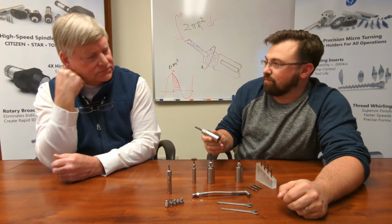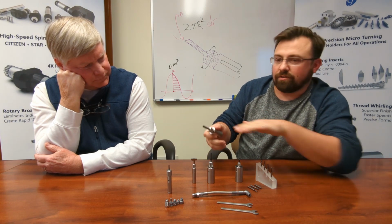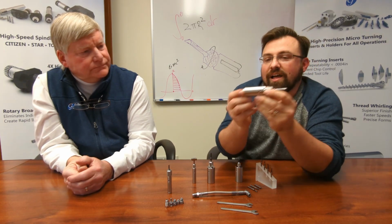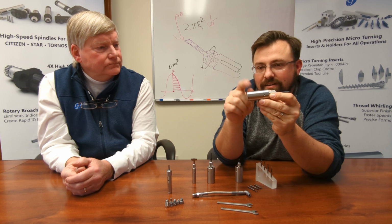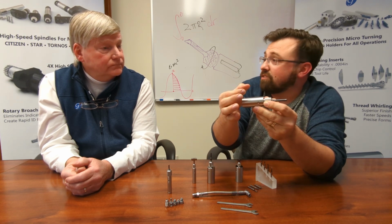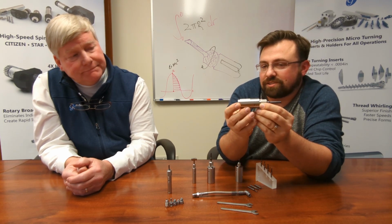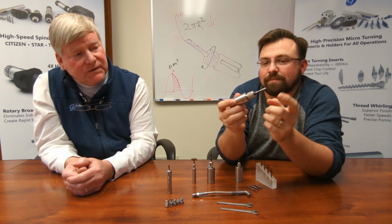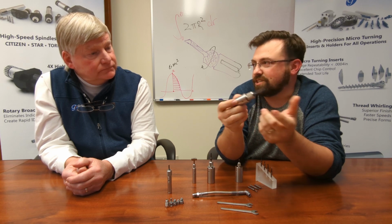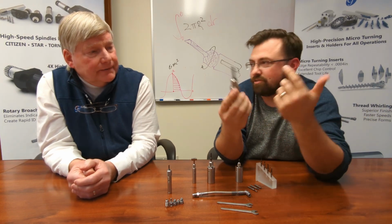Exactly. So you're putting this into a round bore in your tool position, maybe a drop down on the dog leg in the machine, or maybe one of your gang slide ID positions. How do you get everything square? You're locking in on just a regular tool flat on the shank here, and as everybody knows, the end of a set screw can come down onto this and actually behave like a fulcrum, and could cause this to twist in the bore a little bit. If you're working with something as big as this, it might not be much of a concern if you're a couple of degrees out of rotation. It'll probably work just fine, though the closer you are to center, obviously the better. This will be a little bit more forgiving.